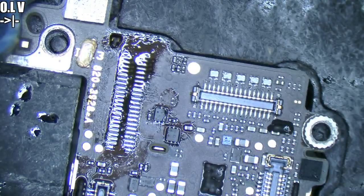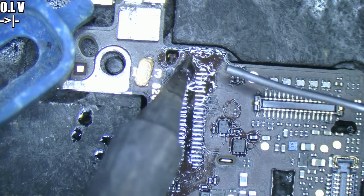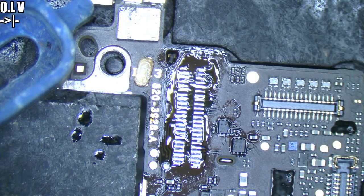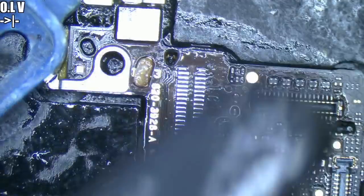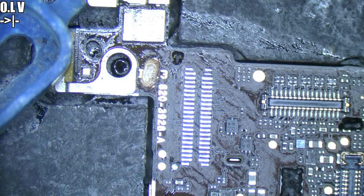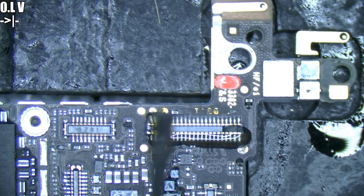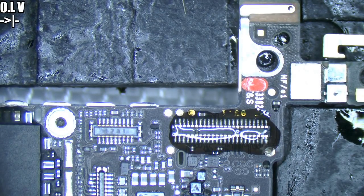Let's put down some leaded. Let's brush that off and check to see how it looks. That's looking pretty clean and nice. Now the fun bit — finally replacing the connector. The real trick with getting the connectors off is making sure you don't melt them. It's fine if you don't need them again, but if you're doing a transplant then you don't really want to damage them.